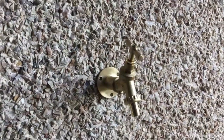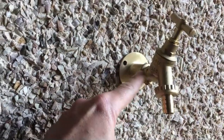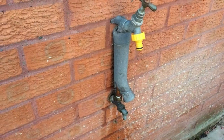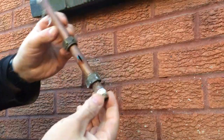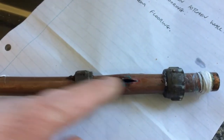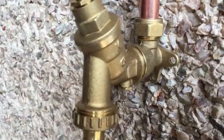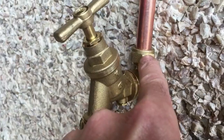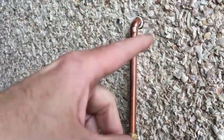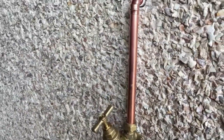There are generally two ways you can fit an outside tap — two fixing methods. This is my preferred method, which is the back plate. The reason I prefer that is there's no exposed pipework for freezing in the winter. I'll link a clip to show you what does happen when you leave water in the pipe in winter — in Scotland, any water left in the pipe expands when it freezes. Another style is a back plate design with a compression joint, just piped through the wall. These are good for when you isolate the water inside — for winterizing, just turn the tap on, and because of the vertical flow it automatically drains the tap, so there's no chance of that pipe freezing.